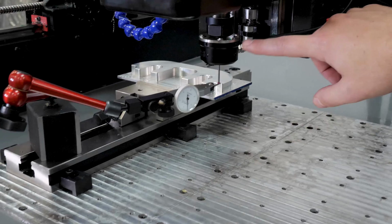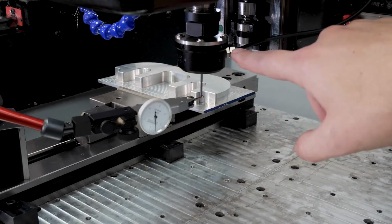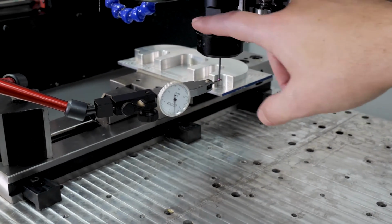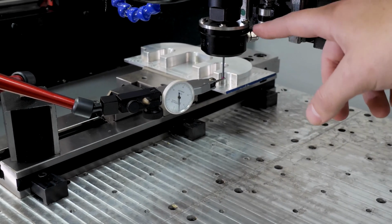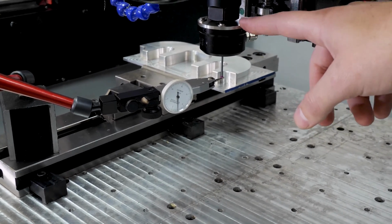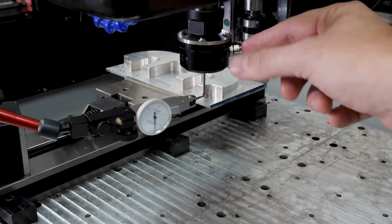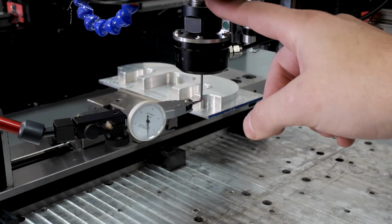You'll notice that along this flange, there are 4 stainless set screws at the 12 o'clock, 3 o'clock, 6 o'clock, and 9 o'clock positions. We just have them loosely installed during assembly, and once you've got your indicator here, you're going to use these set screws to essentially center this probe tip relative to the center of my spindle.